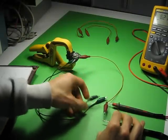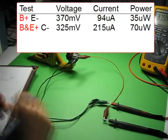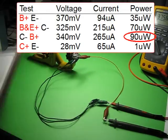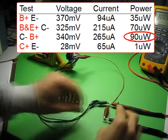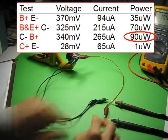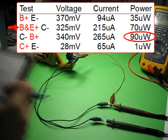To see which way of wiring it worked best, I did some tests by connecting it all the different possible ways and measuring both the voltage and the current. You can see that connecting the circuit through the collector and base gave me the most power. My experiments with sunlight were done before these tests, though, and used a second best option, with the two N-type areas — the base and emitter — connected together.